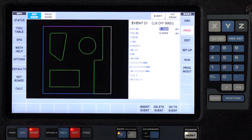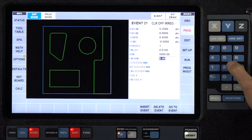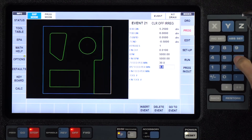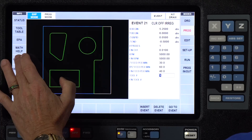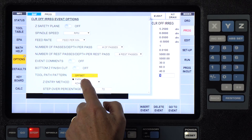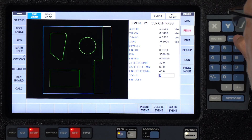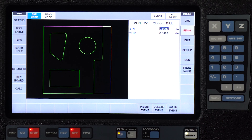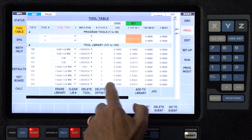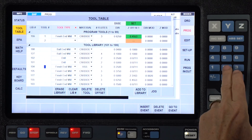Now that I've got that correct, I'm going to go up here to event. Just like before I'm going to come down here and start filling in my information — minus 0.5, one pass, ten thousandths finish cut. I'll put in my RPMs and my feed rates. Before I go any farther, I told you I was going to show you some different tool paths. So I'm going to go over here to my options page and change this parallel tool path to an offset tool path and close that window. The other thing I'm going to do is use two tools — I can do that just like I do in a pocket. So I'm going to use tool number one here, tool number two there, and with the rest passes I'm going to leave that set to two.